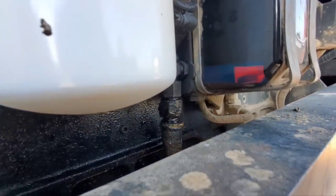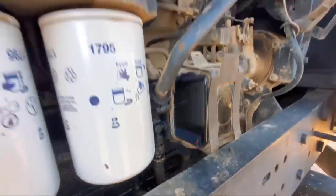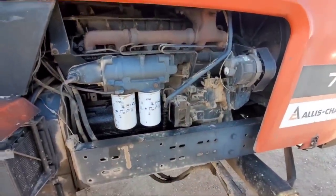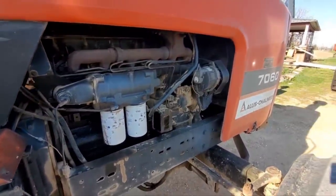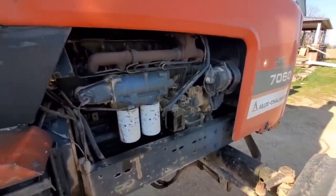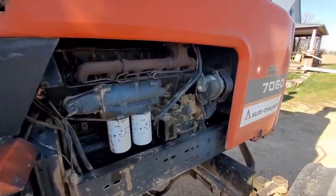here I come and look. You can see the layer of crap. So this is the fourth year using this tractor, and I think this is the first fuel filter I've had to put on it, so I can't complain. And I noticed it before it was really struggling for power. It wasn't very noticeable, actually, just knowing how it should pull.